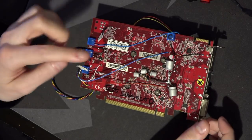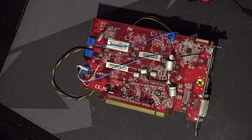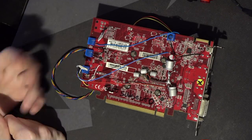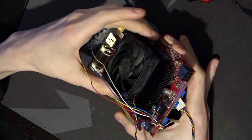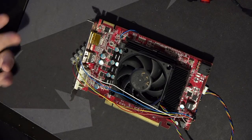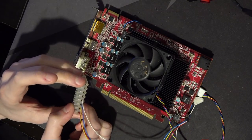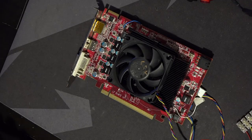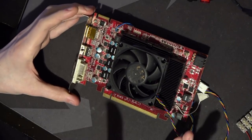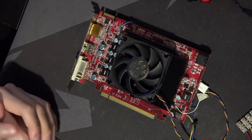There's a bit of a balancing act now, because this doesn't completely fix the negative memory scaling with core voltage, but it does delay it — so you can run higher core frequencies at higher memory frequencies. It's a shame the cooling system is so bad, but that's not a problem on the Vapor X card. The cool thing about the 7770 Vapor X is it actually has a vapor chamber, which is completely ridiculous for such a low-end GPU to have a vapor chamber and heat pipes. But the power delivery is actually exactly the same on both cards, so you can copy-paste your modifications from one card to the next.